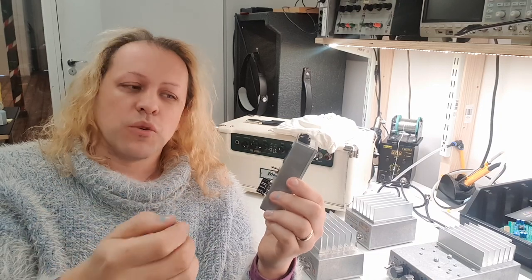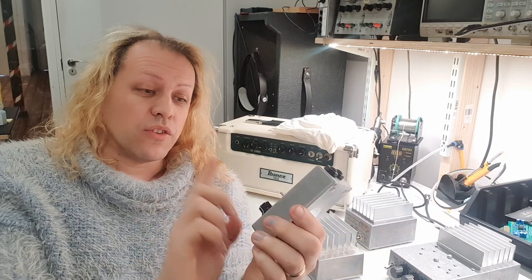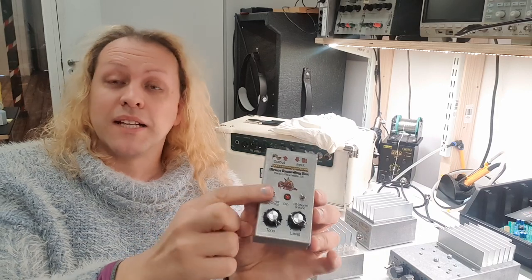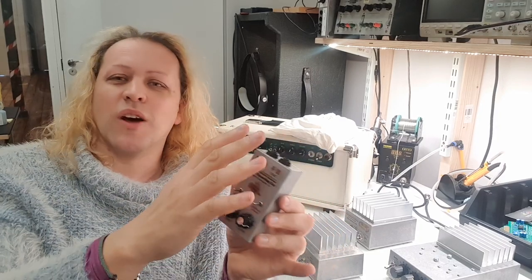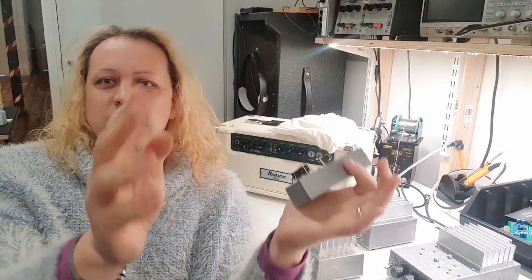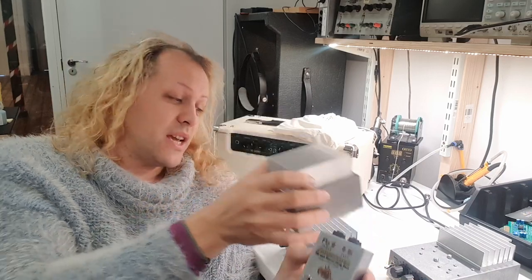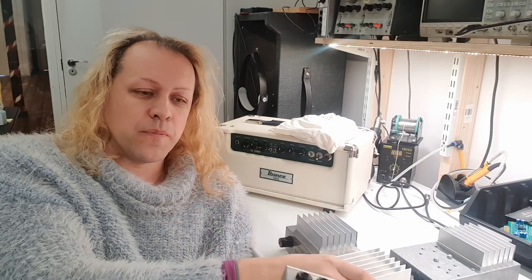The earth lift on the Direct Recording Box works similarly. If your recording device has an earth and your amp has an earth, you'll create an earth loop — the audio path has an earth that loops back through the mains and creates noise. A lot of USB doesn't have an earth, so often you won't need it, but start on normal and if there's horrible noise try flicking it to lift. So we've got the earth lift, the tone control, the protective limiter. In zero load mode, the unit has no load whatsoever and becomes invisible to the amplifier, working well with a load box that's already providing 100% of the load.